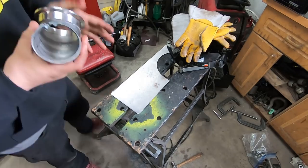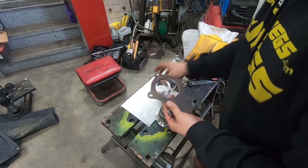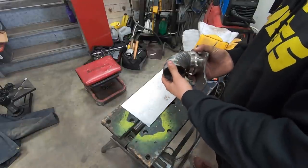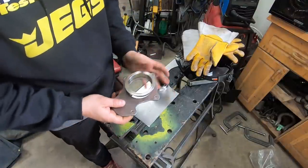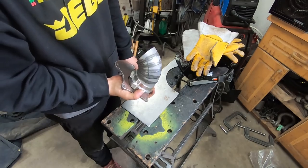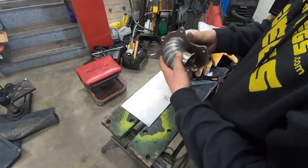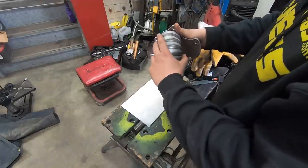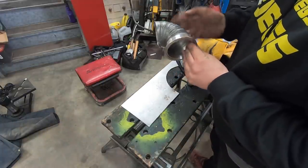Here is the next plan. I have managed to jam the stainless V-band onto my little 90. My original plan was to weld the V-band onto the flange so I can have this be removable — in the future I could put on an extension for a hood pipe or something. The main problem is it's actually sticking out almost as far as the mandrel-bent piece was in the first place, so that's not going to happen. What I'm going to do is weld the V-band to this guy, then weld this in at whatever specific angle is easiest to get the exhaust down and out.